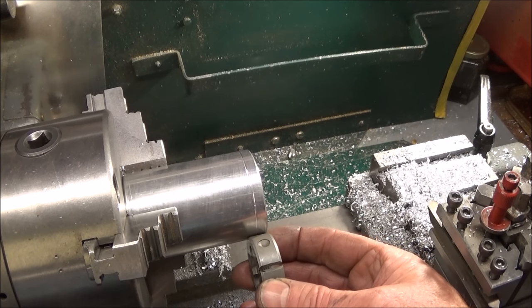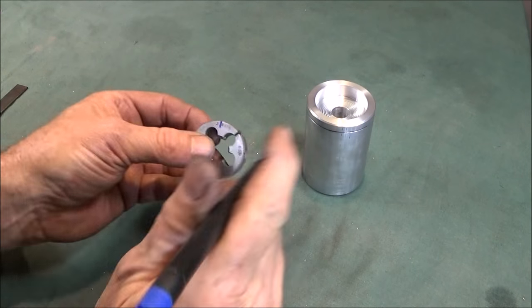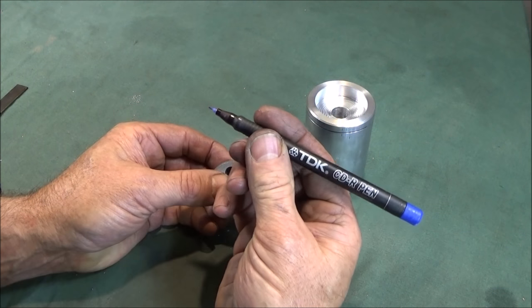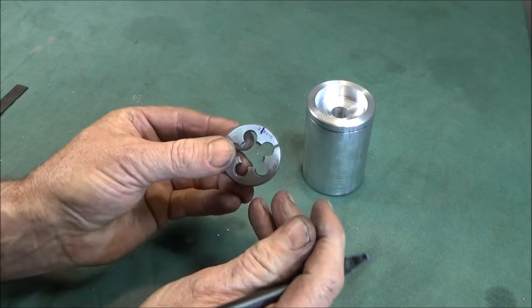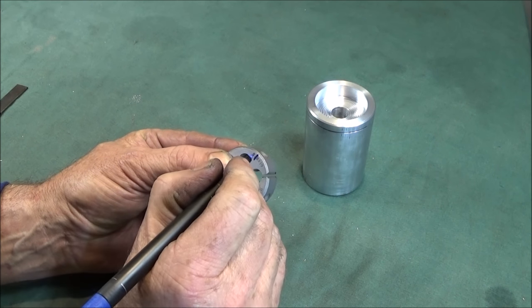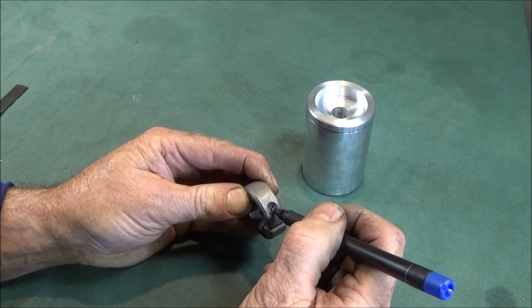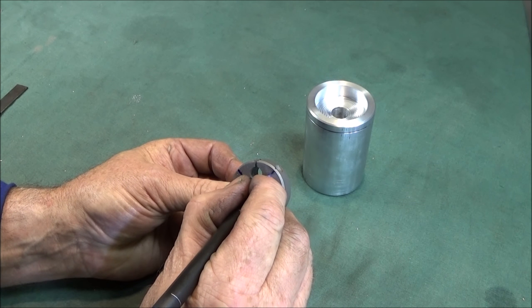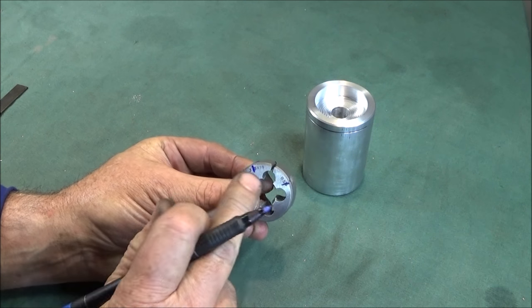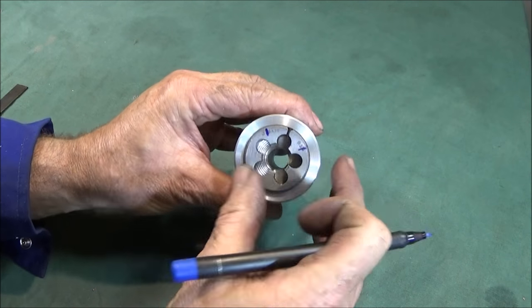And you can just hold the die up to the diameter like that and see that that's central. And then I either get my Sharpie marker pen again, or these CD marker pens are very good, very fine, and sight down from the front face of the die and put a mark in exactly where the center of the indents are on the side, and one that side there, and the third hole will obviously go in the split in the die, and then put that into the die holder